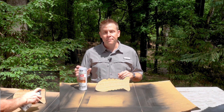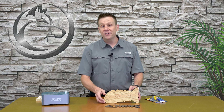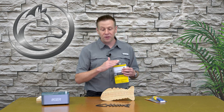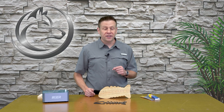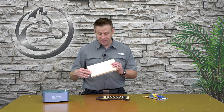While the acrylic is being cut, I'm going to use this time to spray some polyurethane on the wood cutout. Now it's time for my favorite part — joining all the pieces together to create the final work. I just want to check out how nice the finish of that polyurethane spray looks on this pine board. The acrylic cutout is absolutely perfect, and any residue on the surface during the cutout cleaned up quickly with some denatured alcohol on a cloth. The glue I chose is the Beacon Quick Grip — a quick-setting glue that only needs about two to three minutes under clamping force. I do a dry run placing everything together, and I've got a flat board off to the side that will keep everything nice and tight while the Beacon Glue dries.